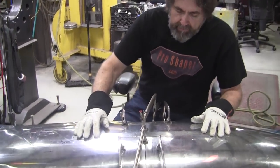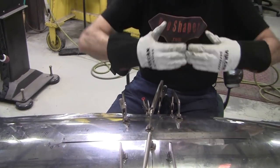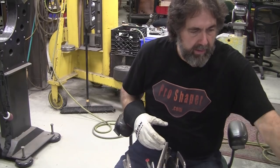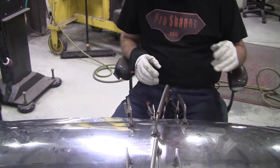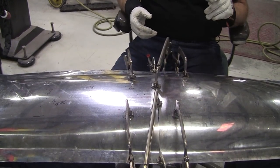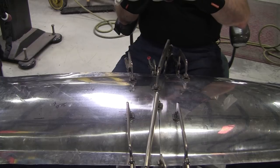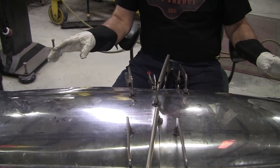And that lines up. And it's dead straight, and that tells you that the panels are together right this way, and the gauge tells you that the panels are together right this way. So you won't have much play to adjust those later on, so you've got to make sure that it's dead right. So I use the gauges, and after I get this all done, I'll put the two flexible shape patterns together and put them on there, and it should lay really nice.